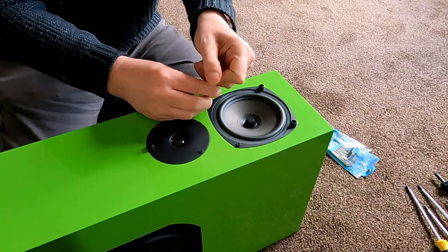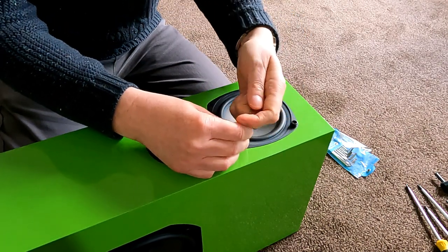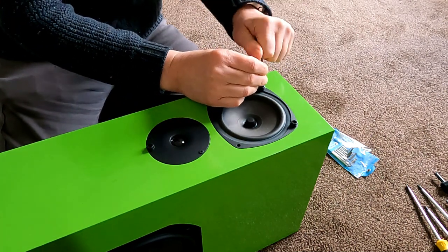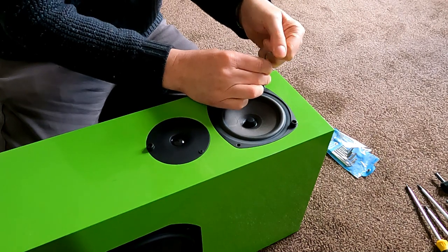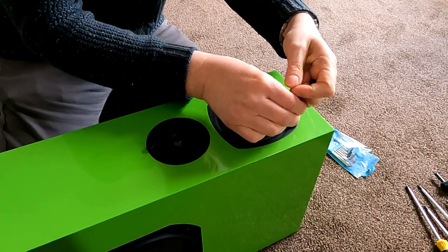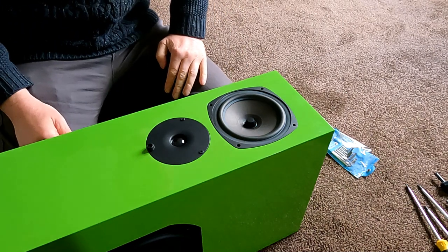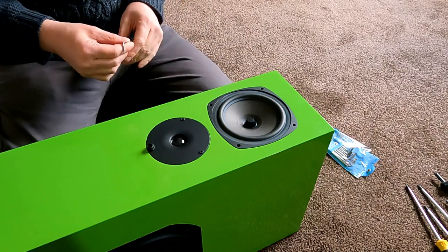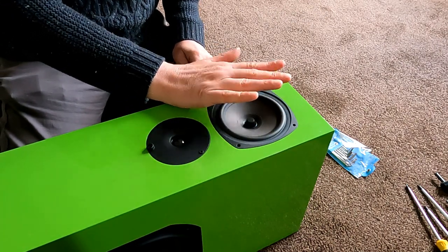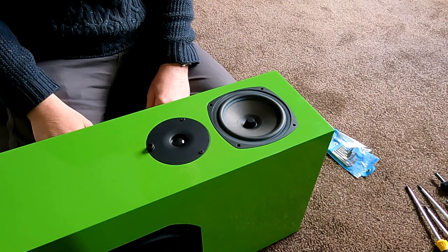The reason for sealing drivers seems a bit over the top, but actually in the 1980s and 90s a lot of speakers were sealed box, and if the box isn't sealed the drop-off in performance is quite major. I used to do a lot of sealing up drivers on things like Acoustic Research speakers, older KEFs, and Missions — it was improving the sound massively. And even with ported speakers, if you seal the drivers it does improve things, because any leakage around the driver takes away energy from the port and alters the response of the drivers and cabinet. So a good seal is great.